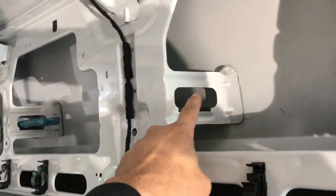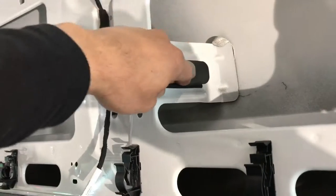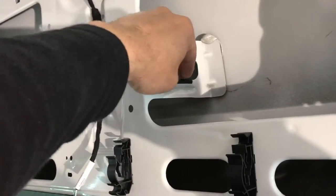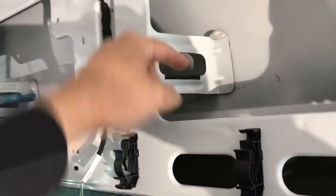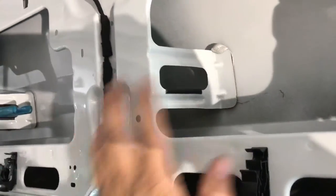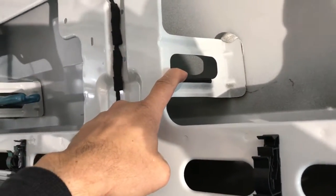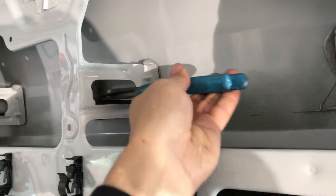The plan is to run the wire here. I put a protector — irrigation tubing from Home Depot — I spliced it and covered the wire through the middle. That way, whatever I decide to apply on either side of the panel or the exterior, I won't have to worry about screws coming in and pinching the wires.